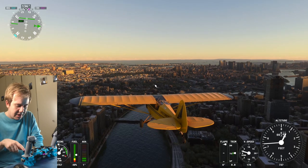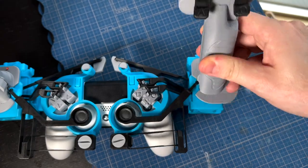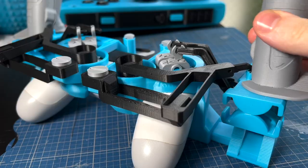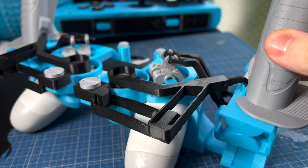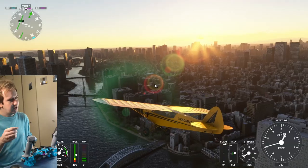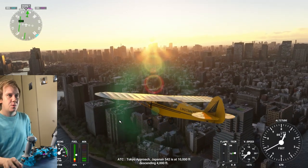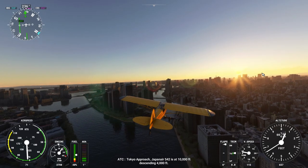The parallel flexure for the XY carriage is a bit smarter now too. This bit is the XY carriage — it carries the X and Y motion from here to here. The X flexures down here are on a lower level than the Y. One is lower and one is higher on top of each other, which means the design is more compact and works a little bit nicer than before.